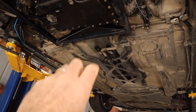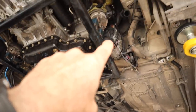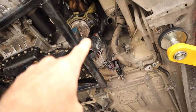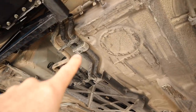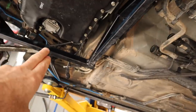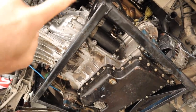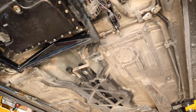Let's go and have a look at what I've got to do about connecting this radiator. Being under the car here, my initial challenge today is to try and get these two radiator pipes connected up to the radiator outlets of the Audi engine, which are both up here. I've also got these two heater outlets right here, close to the subframe. I'm thinking I probably want to try and put them around the other side, since the outlet for the heater is right on top of the engine at the back — so probably easier to run the radiator lines on this side.